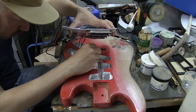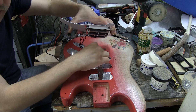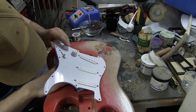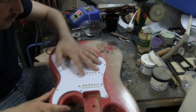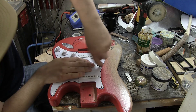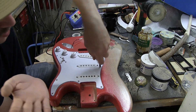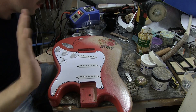The ground wires go through this hole here so they can go to the jack, and this ground wire goes through the little hole that is in the body. I just have to try to match up the pickguard with the body so that it lies flush. There's always something lying a little bit weird so you might have to stick your fingers in to find the right way for it to fall into place. After the pickguard is in its place, you can start screwing in the screws one at a time. Keep in mind that you can't rely on these holes being in the right place — most of them were not. You can just plug them up and re-drill them. Also, if you haven't tested your pickup wiring, maybe only put in two or four screws in the corners first so it's easier to take them out.